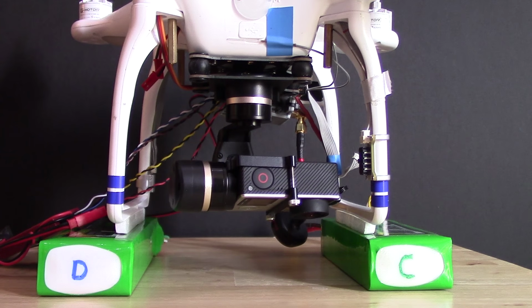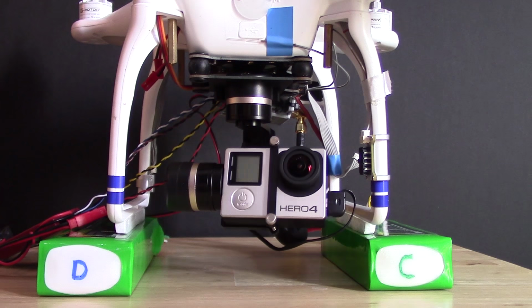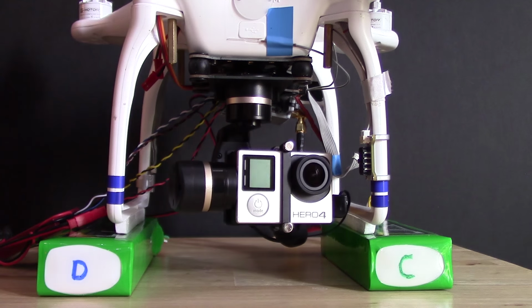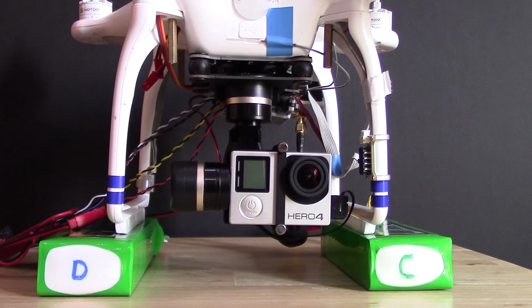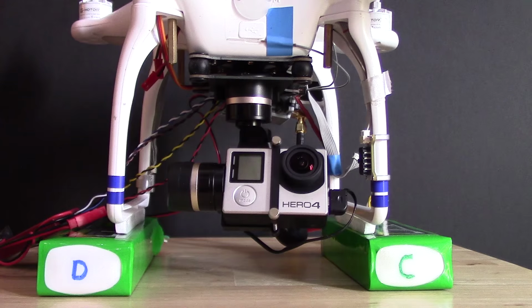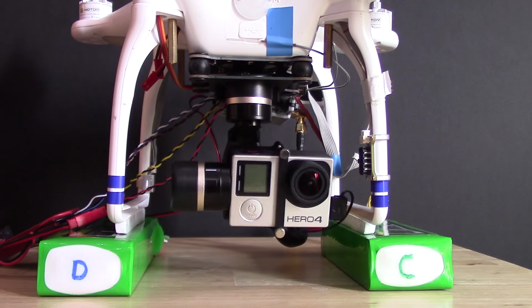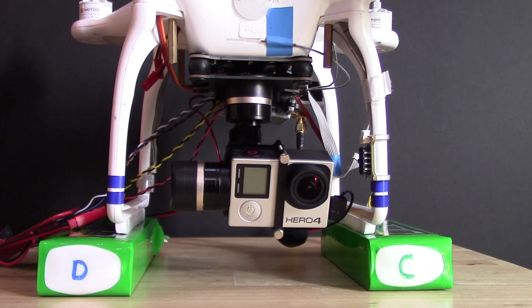So I'm now tilting that fully down, and you'll see it very slowly settles into the correct horizon position. But if I fast tilt forwards, it will tilt around, and then again it will just settle. If I go to the middle, it tilts around, and then settles. So there's obviously a firmware issue there, something needs to be changed. I have to admit, this is the more recent firmware, so I'm going to report this back to Feiyu-Tech. It may be that the original firmware didn't have this problem, and it's not a major issue, but as you can see, if you were doing a lot of panning and tilting, it's doing a pan around, which is very strange. Not entirely sure why it does it.